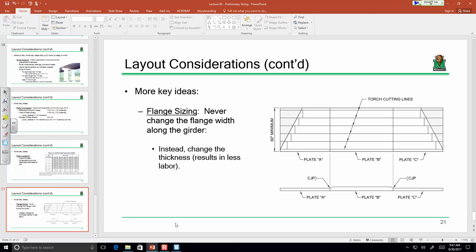You talking about like a grid deck? No, no, I'm sure they're there. I'm saying we're not using them. I'm not a fan of grid decks from corrosion and from freezing and all. Ponding. Yeah, no ponding. No grid deck. Typical reinforced concrete deck.